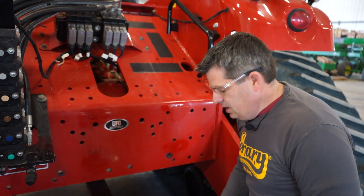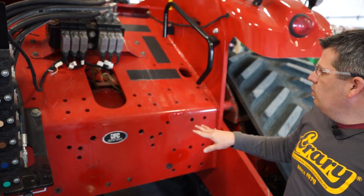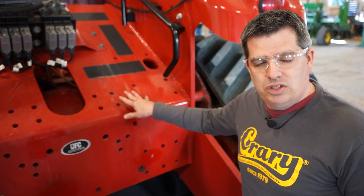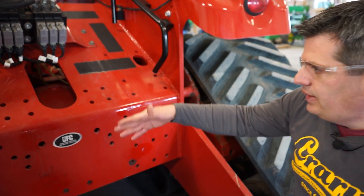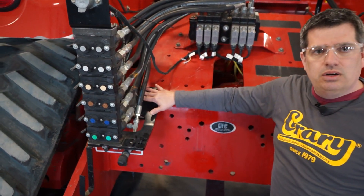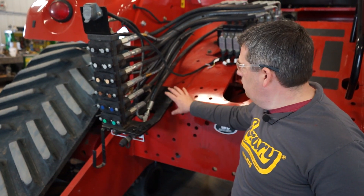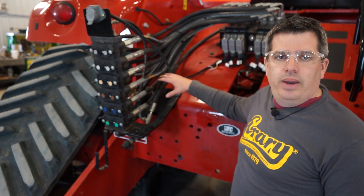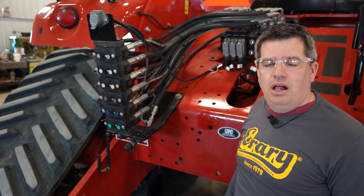In this case we've already done that so our hardware is ready to go. On this install we're going to be picking up on ten different points — the holes in the versatile are already there. We're going to work on five holes here on the mount, and the opposite side hits those same five holes. Over here we have the hydraulics that we'll have to relocate slightly — we'll unbolt that, tie it up and lift it out of the way, and make a few modifications to the underside.